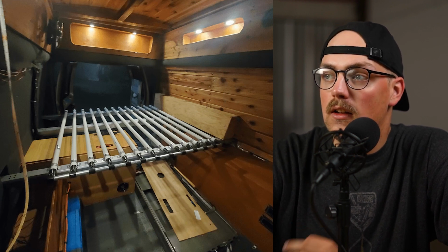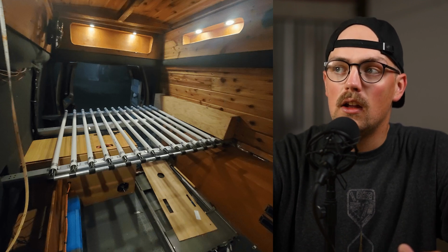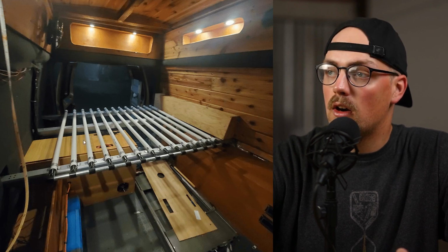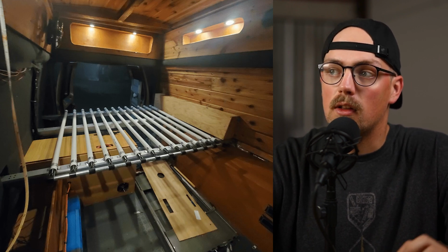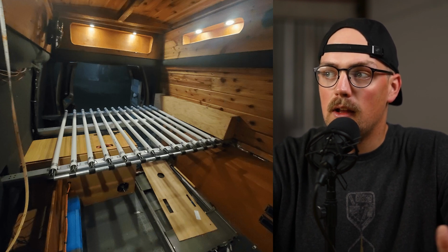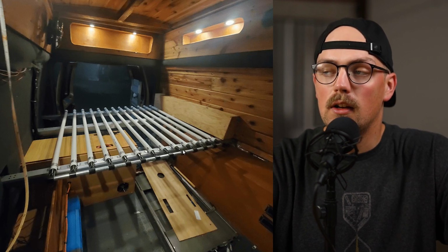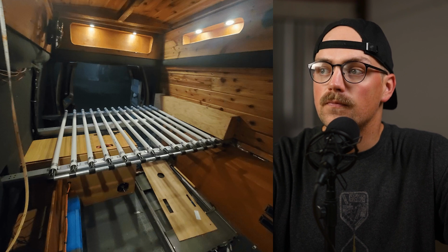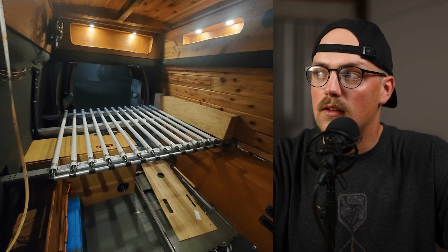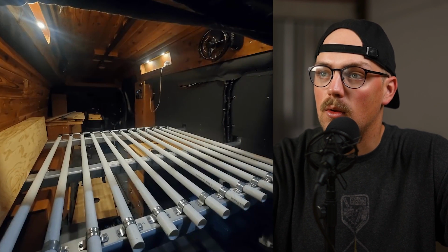But Dan utilized the same technique that Tim first shared a while back, where you put 1-inch PVC over top of the metal bars, and then you secure those to the metal bars with 2 hole straps that fit around them, as you can see here. And then he made a slider extension frame out of 3/4-inch EMT conduit and Maker Pipe T connectors. That just slides in and out and extends the whole frame and increases the bed size. And here's a close-up of the PVC and the 2 hole straps securing those in place.